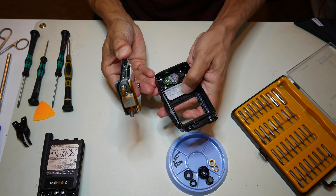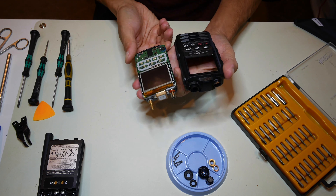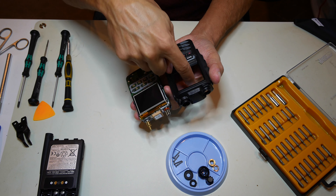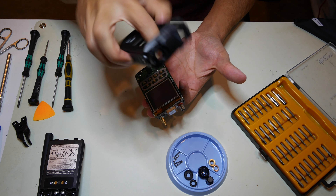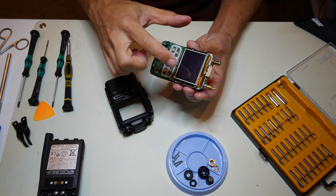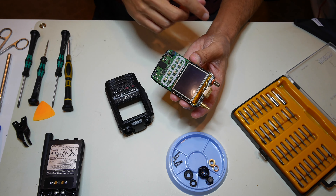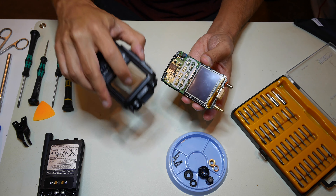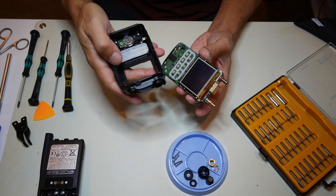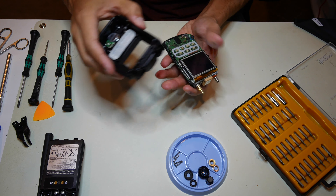Press your buttons back through if they pushed in at all. One notable difference between this and the FT2D: the FT2D has a plastic protectant on the front of the case, but this one does not. On the FT3D you're actually touching the screen directly, and maybe that's why people say it has a better touch feel — because on the FT2D you're pressing through the plastic to the piece below, whereas here they expose the screen and use a rubber gasket to seal it to the front.